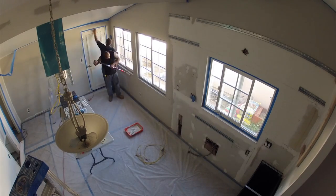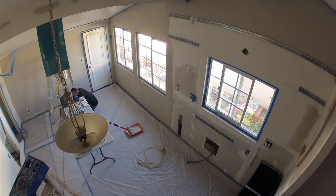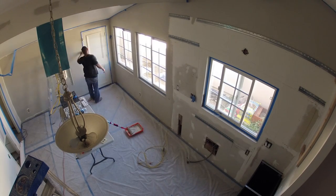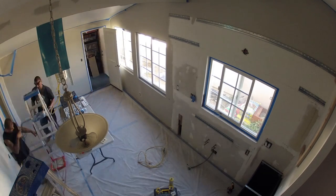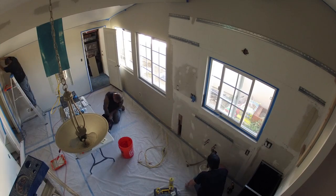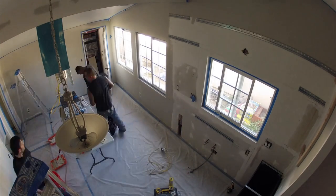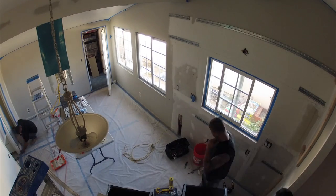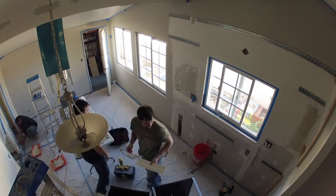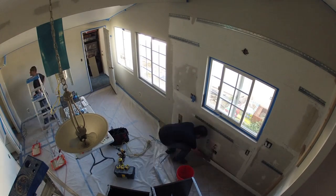There are four plumbing lines that come through here for the sink — hot, cold, reverse osmosis water filter, and the dishwasher — plus the garbage disposal electrical line and the drain line for the sink. I'm muddying that small area. On the right I have the 18-inch base cabinet in place, next to that is a 24-inch open space for the dishwasher, and next to that will be the sink cabinet.